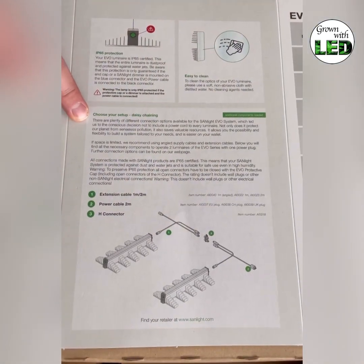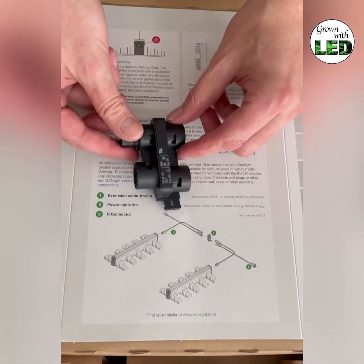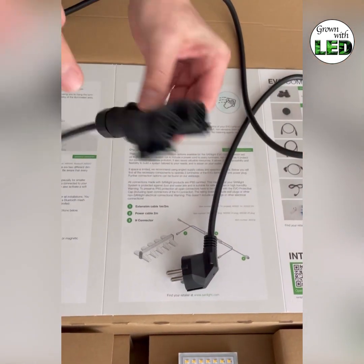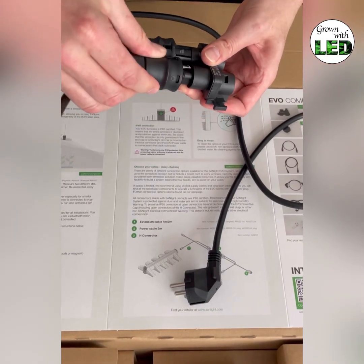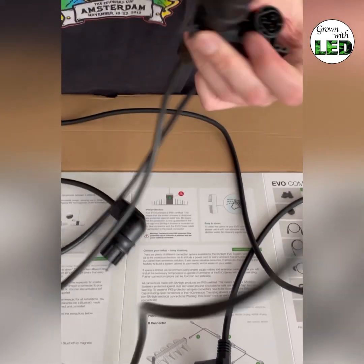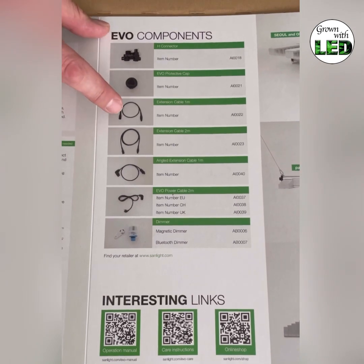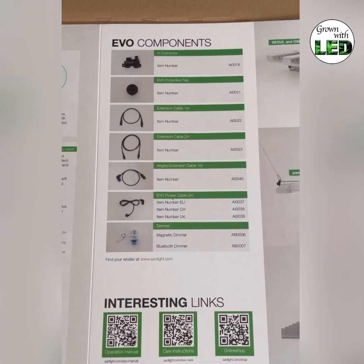Next on the page is the daisy chaining concept — how you use only one power cord and the edge connector to connect multiple lamps. You take your power cable, connect it to the entrance of the edge connector, and then you have three outlets to connect your lamp connection cables. We connected the edge connector and can now supply two lamps with one power cord. The edge connector, lamp connection cables, and dimmer are all sold separately so you can buy whatever you need for your individual situation.